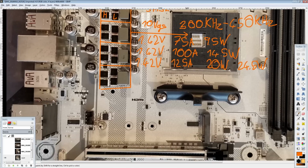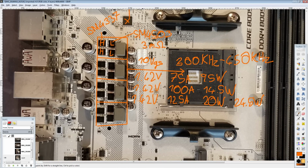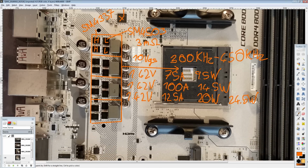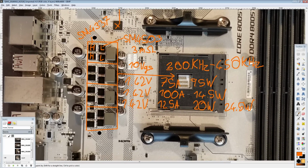And with the heatsink that this has, I expect this to do absolutely great in VRM thermal testing, because this has so much surface area compared to a lot of its competition that it should have no problem handling the VRM heat output. So yeah, assuming the BIOS is good, as long as MSI hasn't screwed up the BIOS, this should be a great B450M ATX motherboard for CPUs, and all of the other boards too, because MSI recycles this VRM across a bunch of other boards as well. Of course they do, otherwise they wouldn't do this.